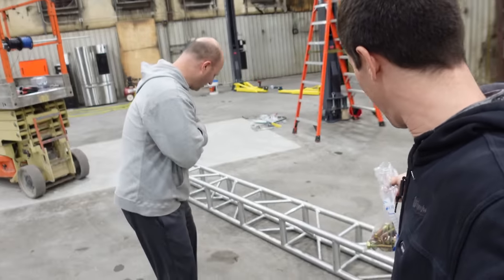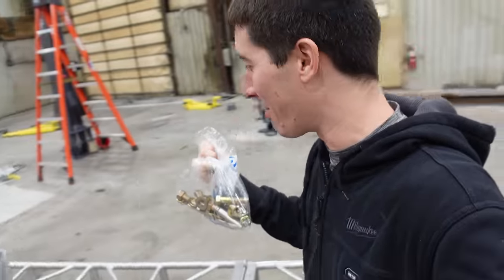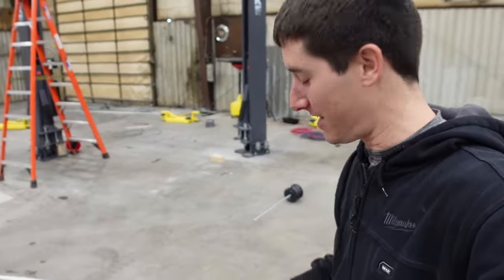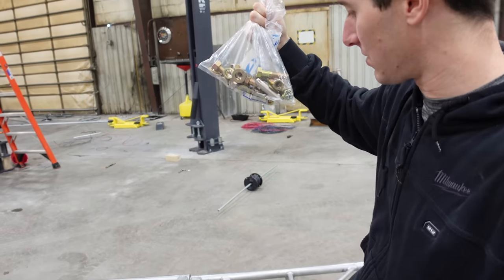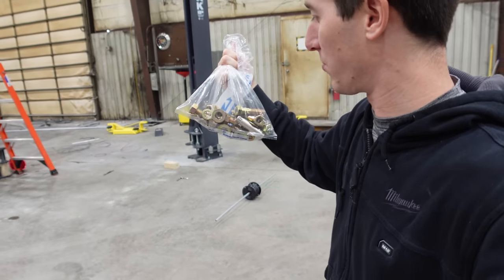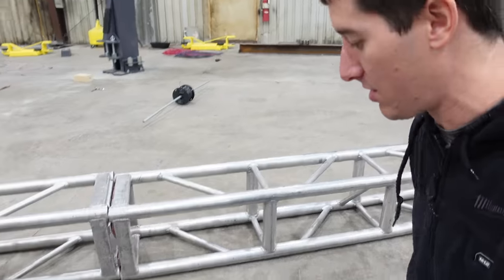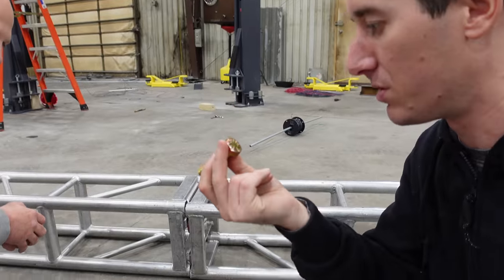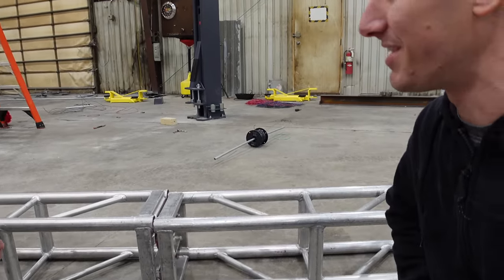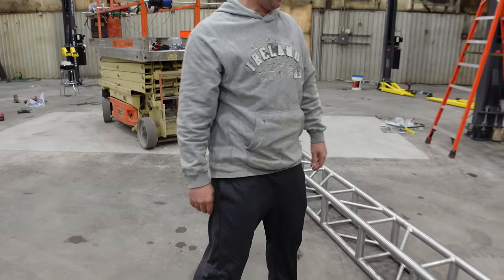And the last one — Josh is here. What we're going to do now is bolt this truss together and get ready to hang it in the air. We have grade 8, 5/8 hardware with a big shank so there are no threads in case it ever moved — figured it would keep it from abrading. This should be way overrated for what we're holding — times four at each joint. This ham radio station is going to be killer. Yeah, we'll just put the antenna on that and stand it up, no big deal.